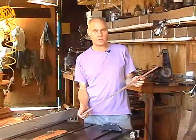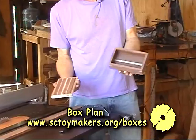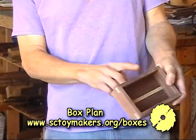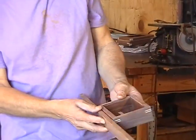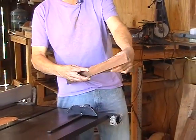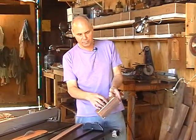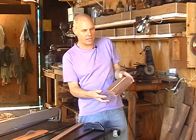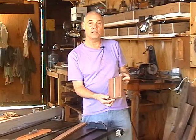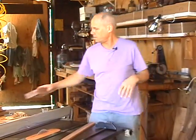We're going to build this up into strips that are going to be the sides of the box. Here's the finished box — we're going to do it step by step. You can see the thickness is the same and we're just going to wrap it around like this. The bottom has actually been set into the sides of the box — it's called a rabbet in woodworking. The first thing we're going to do is cut that little trench.